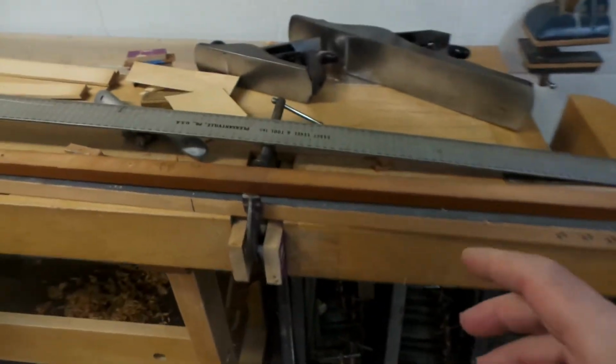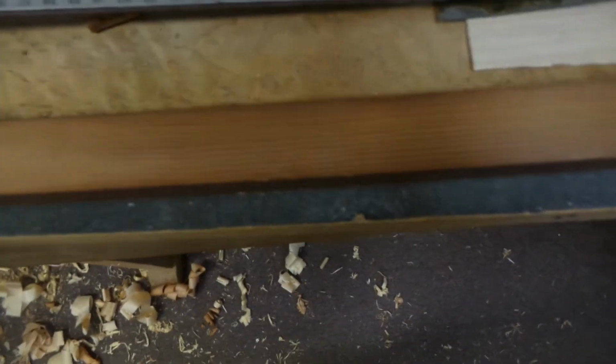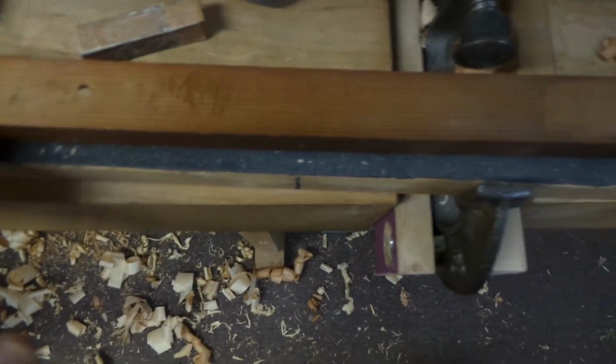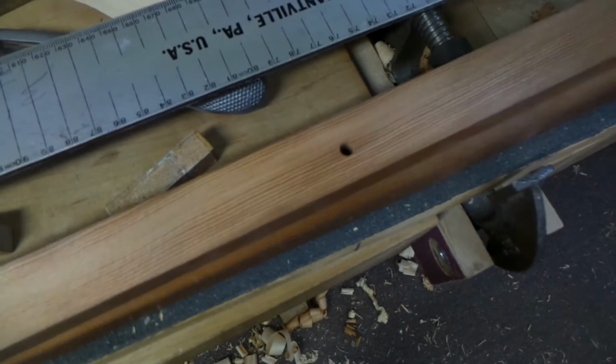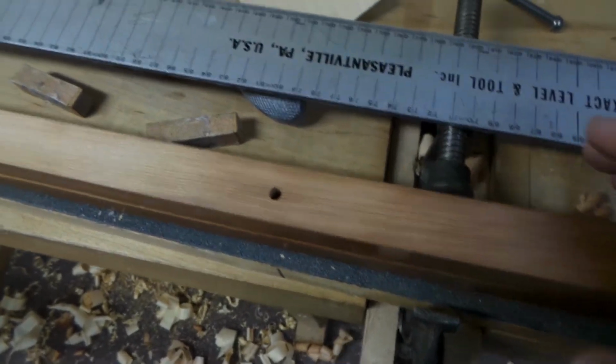Here's a rib. Here's the bottom of a rib, what they look like after I took them off. And this is the glue surface. You could clean this up and glue a piece of wood on here. It would be decent. It might be fine, but really the better way to do it is to take a plane like this and replane the surface, so it's clean wood, bare wood, smooth, totally straight from one side to the other.